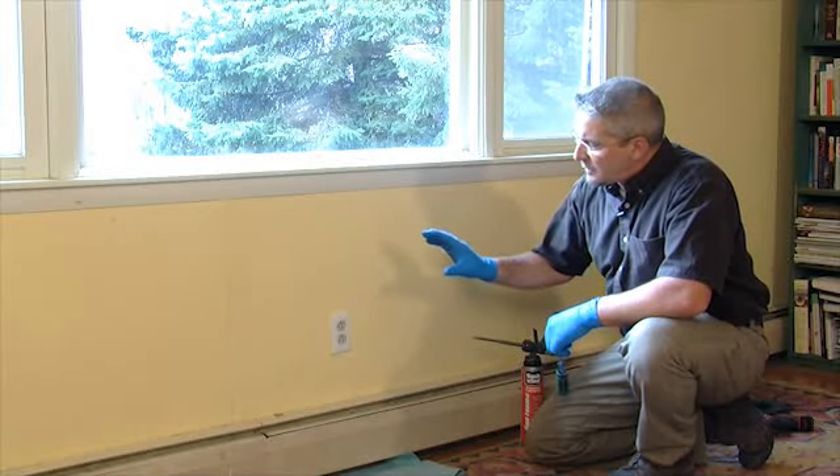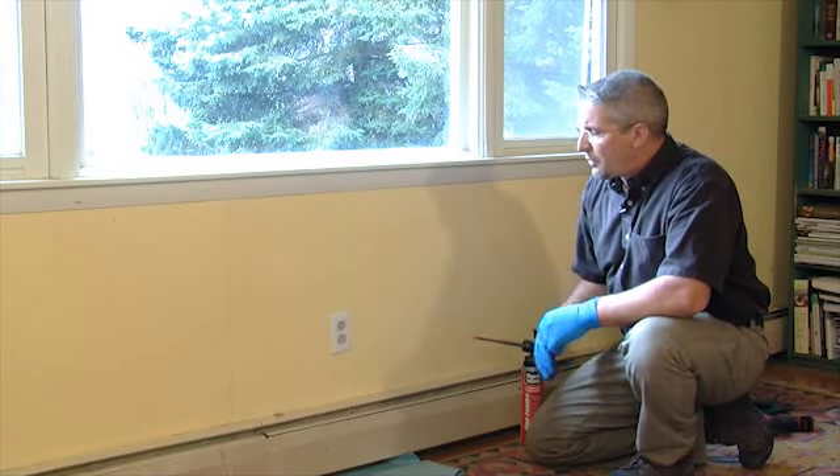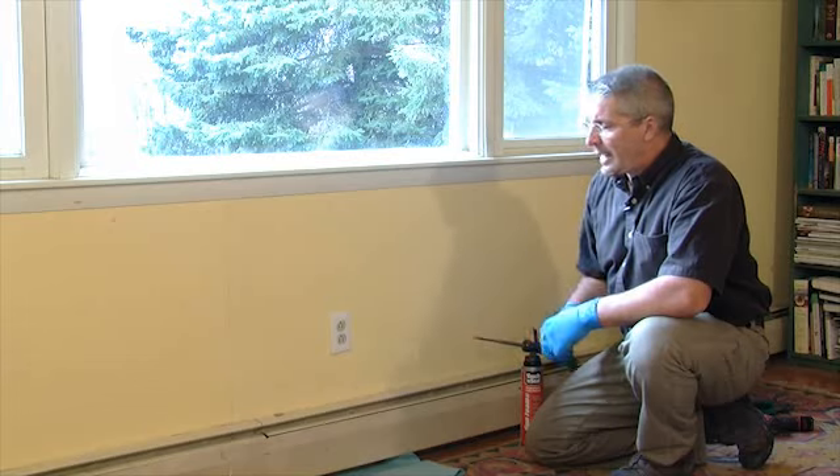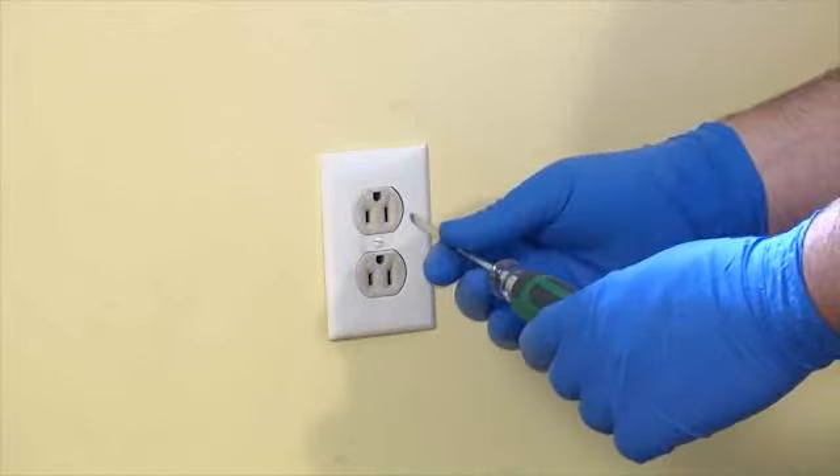What we usually like to do is first make sure power is turned off, because you will be dealing with the electrical outlet first, and that could be definitely an electrical shock hazard. So I would start by first turning off electrical power, then taking off the faceplate.